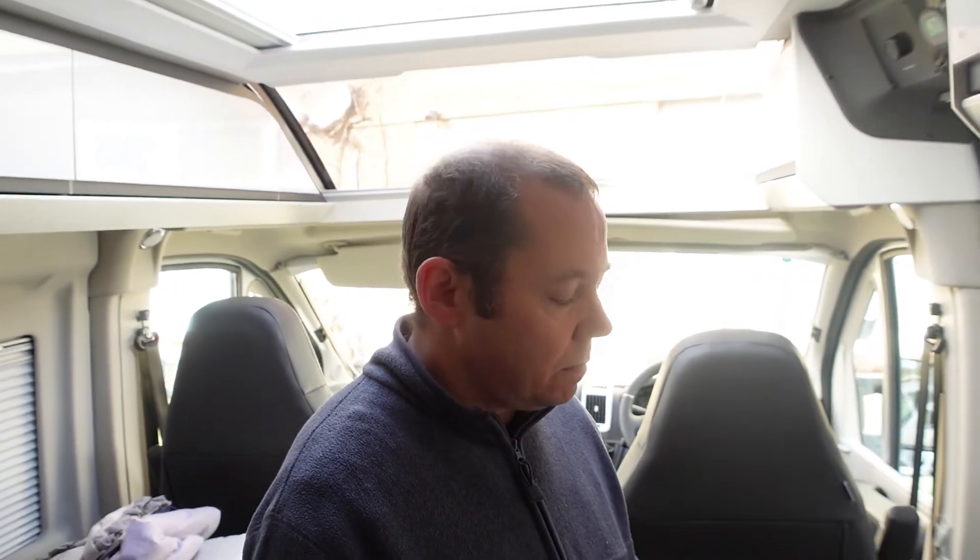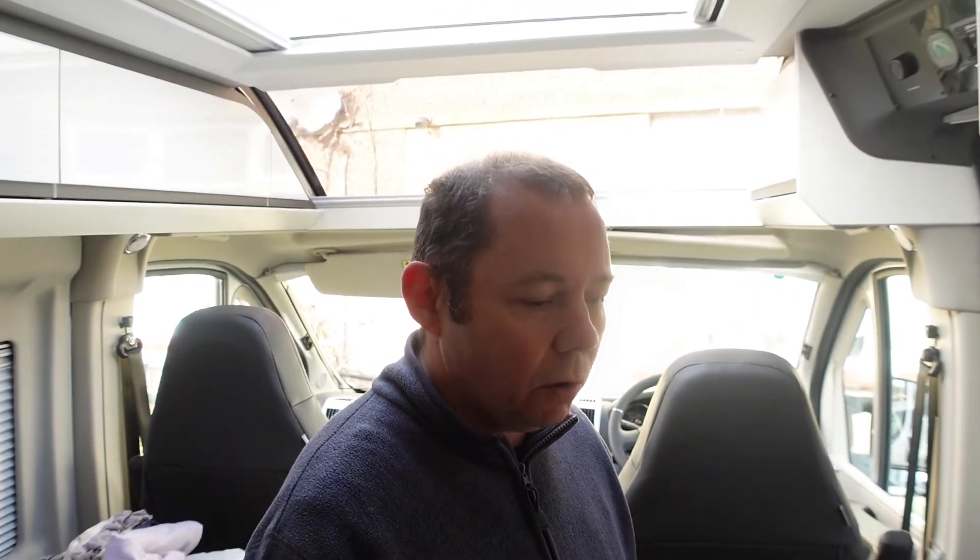Hello guys, welcome back to the channel. Just going to do a little short vlog about the battery monitors on the van. I did a review on a battery monitor not long ago and someone pointed out that the one I reviewed can go into negative readings on the amp hours when it's at 100 percent - so when the charger has the battery up to 100 percent and the gauge thinks it's at 100 percent, it still shows full capacity but the battery is still taking on current and it starts reading negatively on the amp hours.